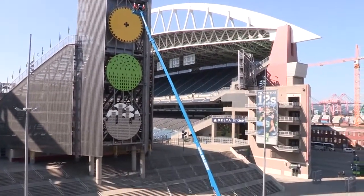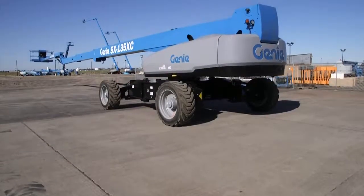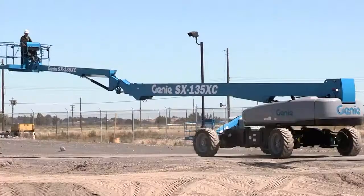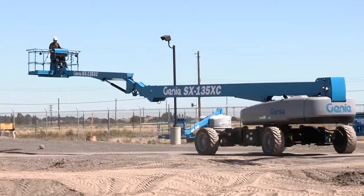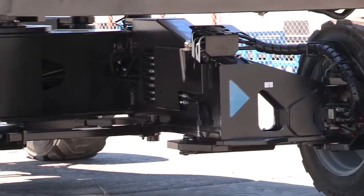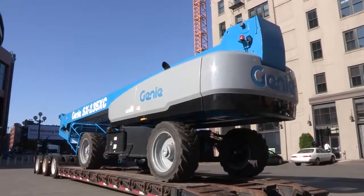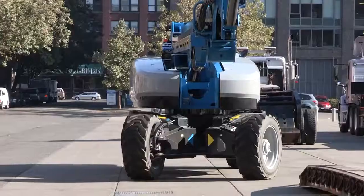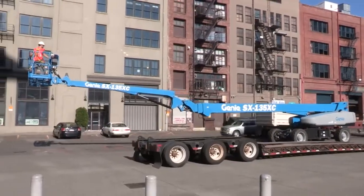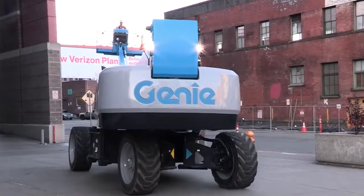This is an X-Chassis machine, but it's the first to offer our Mini X-Chassis. This means that it has a smaller footprint that still provides the stability and performance we expect from our booms. On the SX135XC, we shortened the legs to take it from a 16x16 on our larger units to a 13x13 footprint. This really helps with maneuverability in tighter applications like urban areas, where it lets you only take up one lane on a site to keep from restricting traffic.